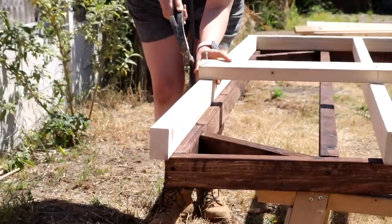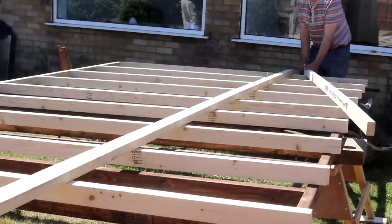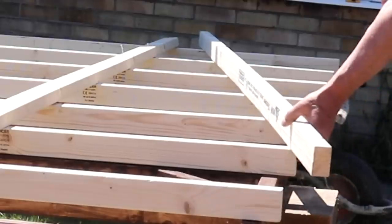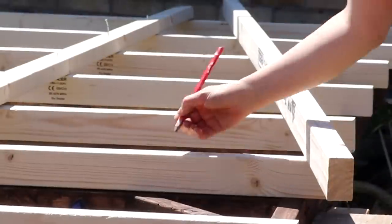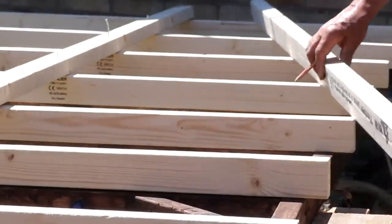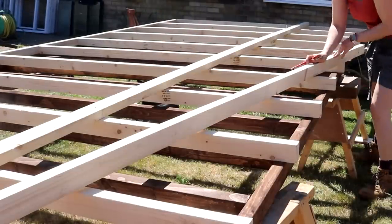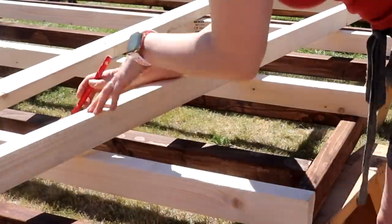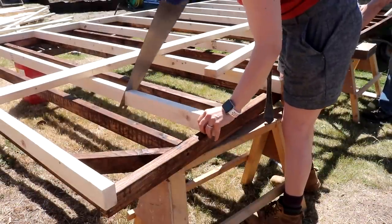I'm now about to create a pitched roof. We marked 1900 millimetres from the bottom for the lowest part of the roof. Then placed a large batten on the inside of the 1900mm pencil line and angled it towards the centre spar. My dad said it was a good idea to mark C for centre on that centre one to prevent confusion. After finding the centre spar, I lined it up with the opposite 1900mm side and top of the centre spar and drew on the inside where it lied on each spar. I repeated it on the other side, then cut along my pencil lines for an angled roof.